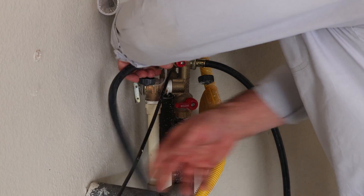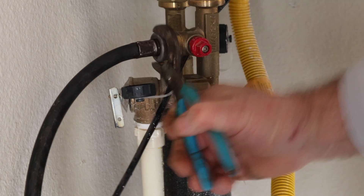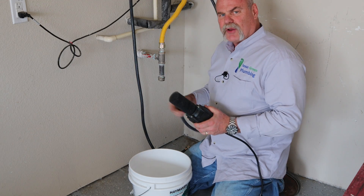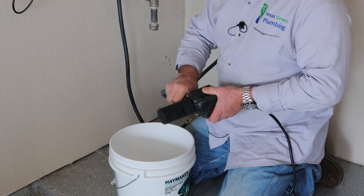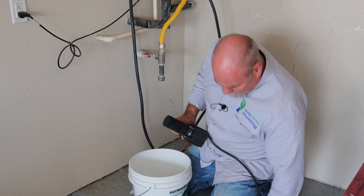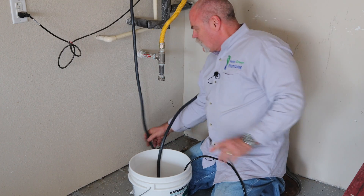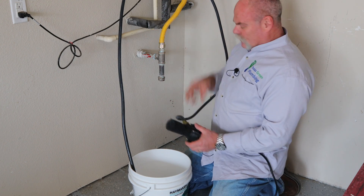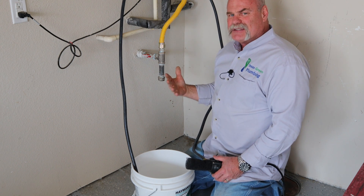Some people will tell you to flush the water out of a tankless water heater before you flush it — I like leaving that water in there. That way I don't have to add as much water to my bucket to mix the chemical in with. Make sure each hose connection is on there tight so it won't leak. So this is the circulation pump. I'm going to take the other end of the cold water inlet hose and attach it to the discharge side of the circulation pump. I know this is the discharge side because I've got a filter on the inlet side. Once you put this in and snug it up, you're going to drop it down in the bucket. The hot water side, all we've got to do is literally drop it in the bucket. We're creating a closed loop system — the chemical will pump through the system, go up through the heat exchanger, and this is going to clean the calcium and magnesium buildup off the inside of the heat exchanger.